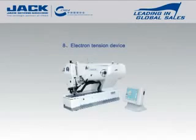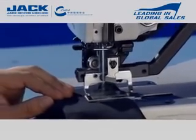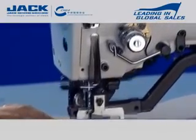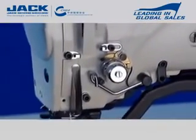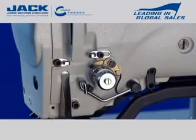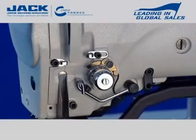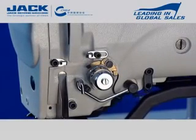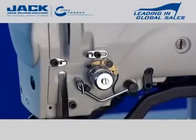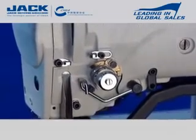Electronic tension device. The operation box can adjust the tension of the thread in the whole process of bottom sewing: starting of sewing, baseline sewing, bar tack sewing, thread trimmer, and ending of sewing. All data can be saved. Not only does it guarantee beautiful stitches, but it also prevents thread breaking, skipping stitches, and the thread trimmer not catching the thread, etc.